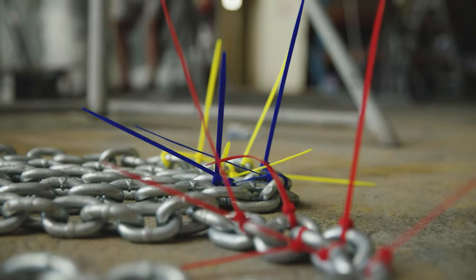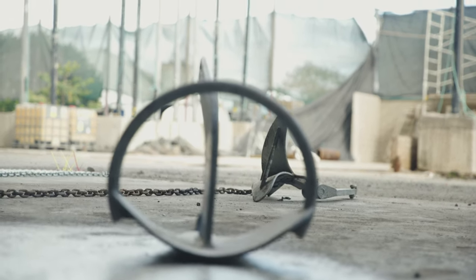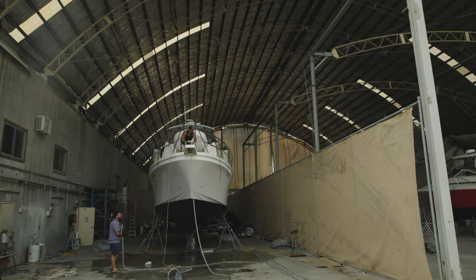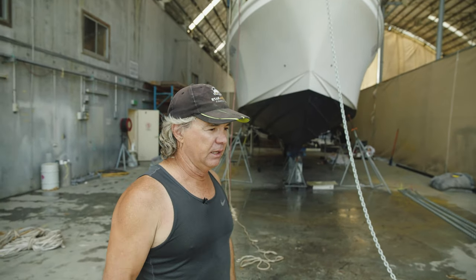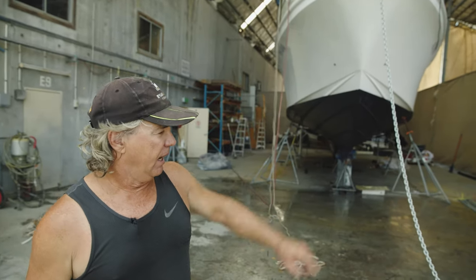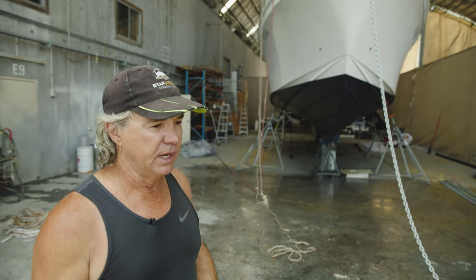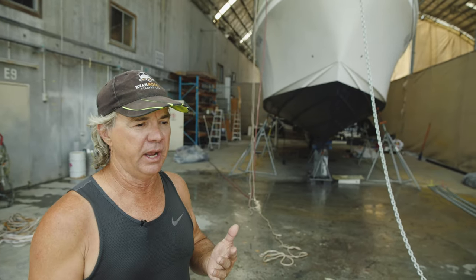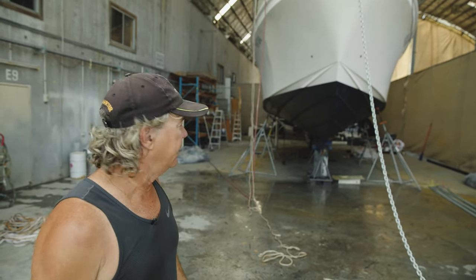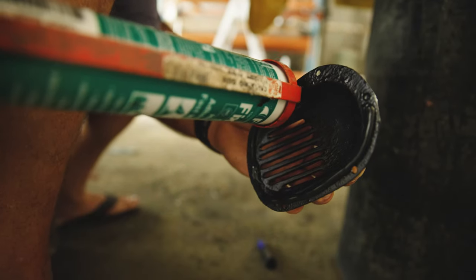This morning we've got 70 meters of three-eighths short link chain to run through the winch — it's brand new chain. We've marked it every 10 meters in different colors, and the last three meters in multiple colors with cable ties. As long as the cable ties are a bit loose they'll pass through the winch without breaking off and polluting the ocean.